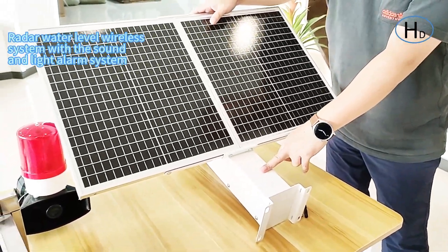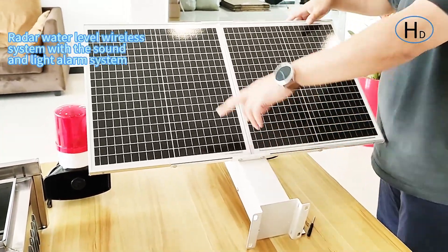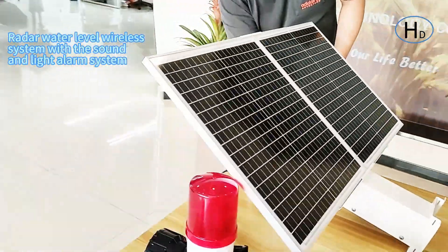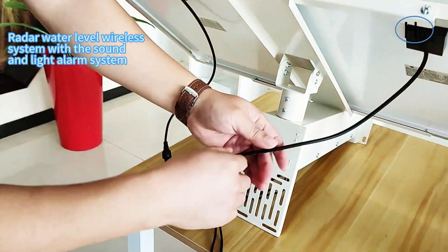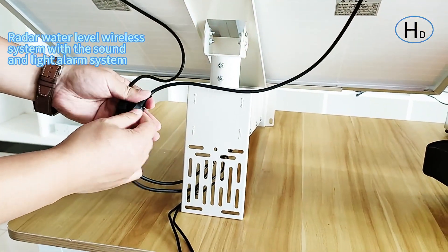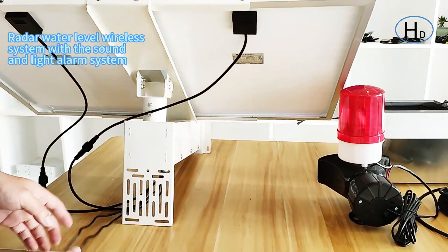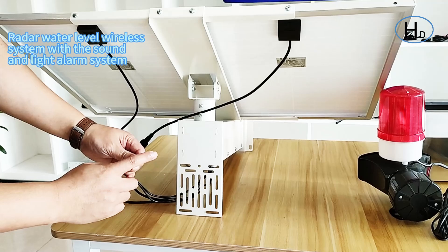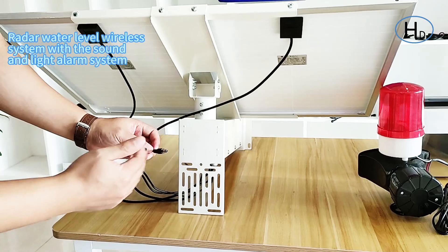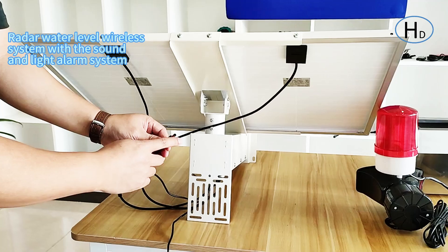This third part has a built-in battery which can power supply the sensor. For the connections: here are the two solar panels connected by a waterproof connector to the built-in battery. For the power output port, you can use any of them — they are in parallel connection. The output is 12V DC.